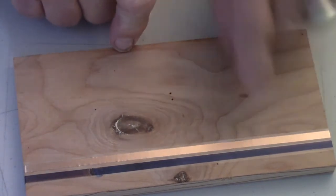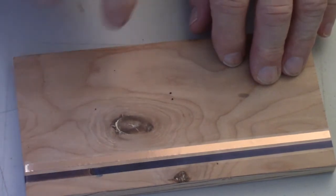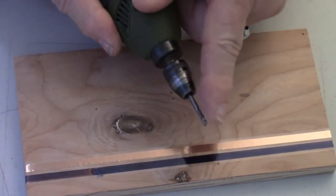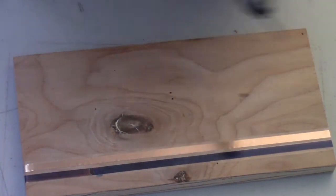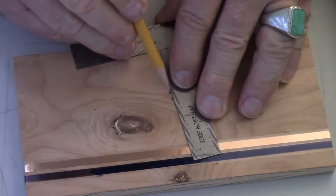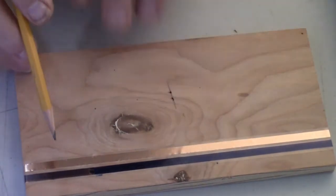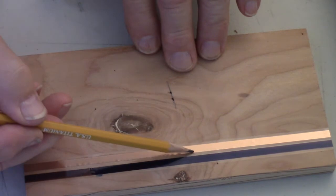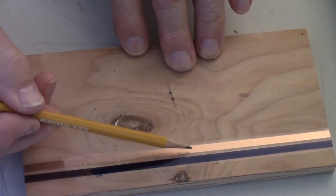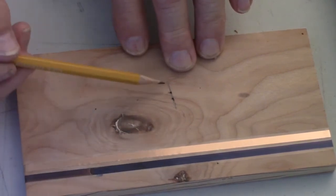I'm going to show you a couple little tricks that I like to do. Before I put the micro jacks with a tail and the wire coming up this way on the ceiling side, I want to take my Dremel, which has a grinding bit on here, and grind across those two holes. And I'm going to put a line on here. One thing we can do is run that pencil line all the way over to the tape wire and make a channel so that the wires would lay into the channel and then connect to our two copper strips on our flat tape to give us the electrical connection that we want.